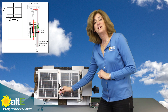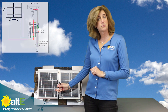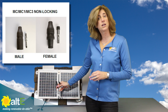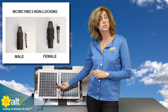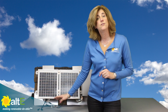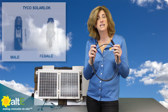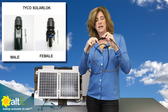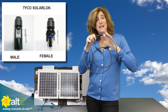First thing I'm going to do is check if they've already got wire coming off the solar panels that have solar connectors on them. I've got some older panels here that have the non-locking MC connectors, so you can see they'll just plug into each other without needing any kind of tool to disconnect them. If you've got newer panels — probably newer than 2008 — you'll have some sort of a locking connector with little tabs that when you plug them in together, they lock and you need a key to disconnect them.